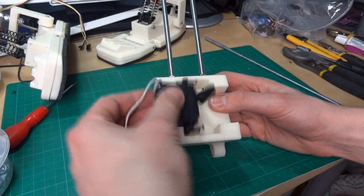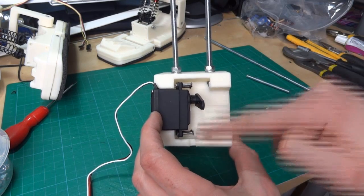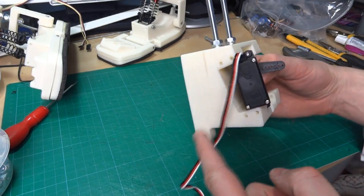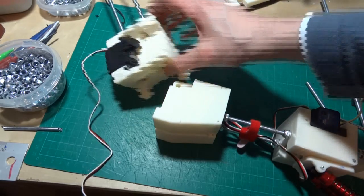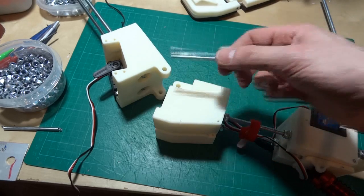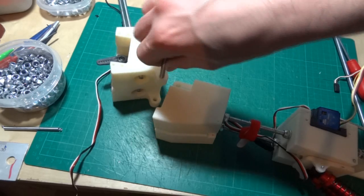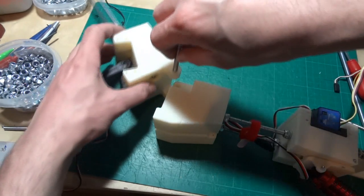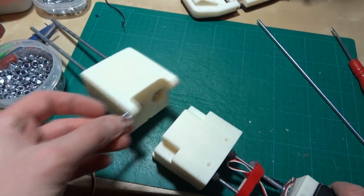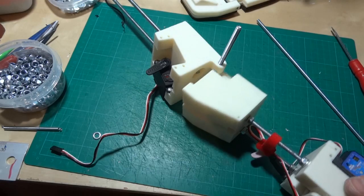We just need to put a servo in — I've decided it's going to go this way so the servo horn is at the top, giving space to attach the spring. I'll probably need a short linkage to meet the spring too. This servo is on the outside so this is the right-hand leg. I've made the holes the right size for M6 studding — the ABS shrinks as it cools so these have to be screwed in, which makes the joints nice and tight so they don't wobble. I want to get M6 washers in the gaps as well, which can be a bit of a challenge.